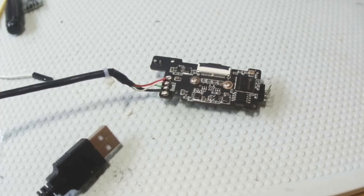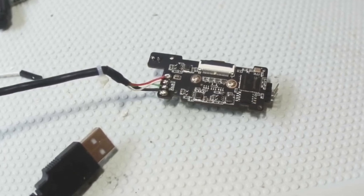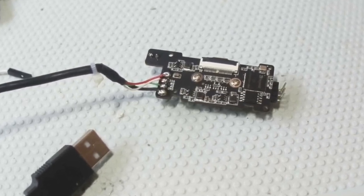The camera itself is interesting because it doesn't use a generic sensor-to-USB chip. Instead, it's using a 32-bit MIPS processor running a Linux OS, and it's an easy soldering job to gain root access and be able to run your own OS and software. Check out my other videos on the topic.